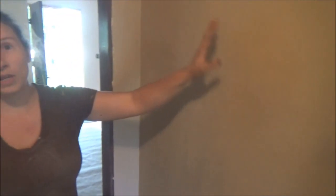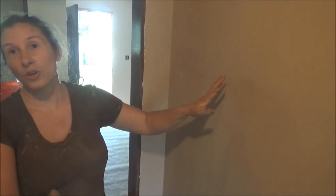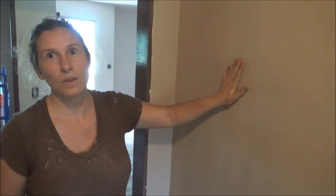Now will this chip off? Oops, I guess so. Yeah, right here on the edge, because there's a little bit of movement right there. But say you were to hit the wall and it got a chip in it. Well, that's the good thing, you can just rehydrate the wall and get your patch kit. You always save a little bit of color, let it dry out, then rehydrate that and fill in your little dent. That's so cool. Yeah, and what I did is I tinted the base coat, which you don't have to do, so it's the same color. In the dark room, I thought that would be good because otherwise it would be pretty much white under there. So at least when it chips, it'll look blue. That's cool. Yeah, super easy to fix mistakes. That's great for filling holes from hanging pictures or something like that.